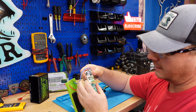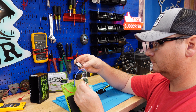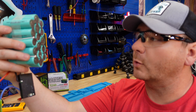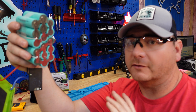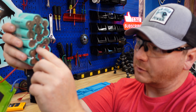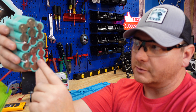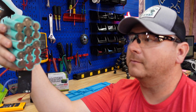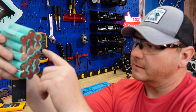I do like that they tied down their balance leads. This pack is a 4S4P pack, meaning there are four cells in series and each one of those series cells has four cells in parallel. So these four right here are in parallel with each other, these four here are in parallel with each other — those two groups are in series. You have the same thing on the opposite side, giving you your 12.8 volt nominal from four cells in series.